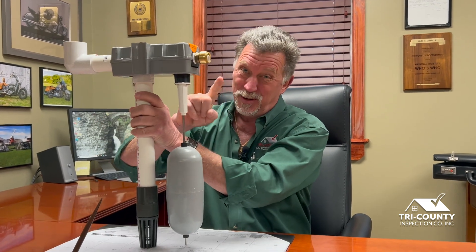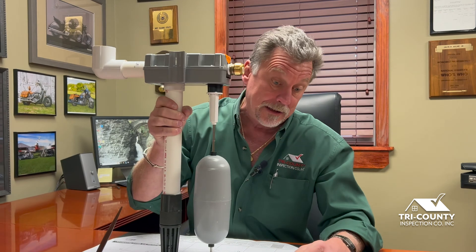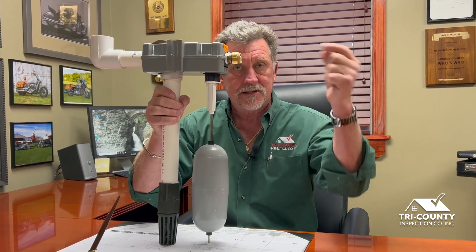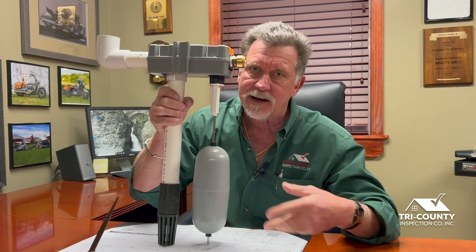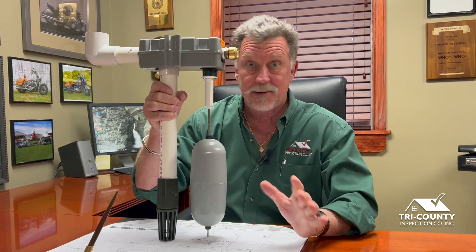Make sure that in your sump pit the water is clear. Sometimes you look into sump pumps and it's basically a stone bed with a little bit of mud or muck in the bottom. This strainer here has to be in clear water, not disturbed water. Also, you cannot discharge any sump pump into the sanitary sewer — except in the cities. Philadelphia will allow sump pump water to go into the sanitary sewer because they regenerate it for future use, but in most of the suburbs it's a finable offense of up to about $1,000.